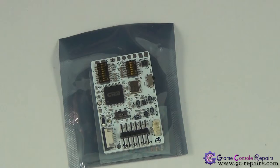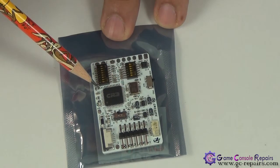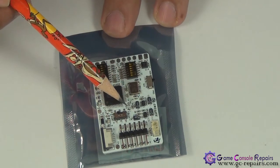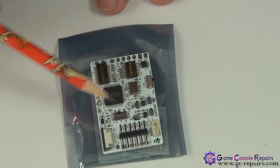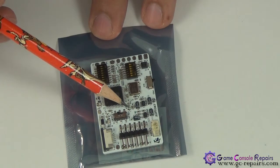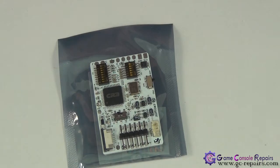Other changes introduced when comparing to CoolRunner A, B, and C revisions: they have added 4 LK solder pads located here — LK1, LK2, LK3, and LK4 — all of which come open. LK4 has 3 solder pads: 1, 2, and 3. Depending on your console type, you either need to leave them open or bridge the connections.